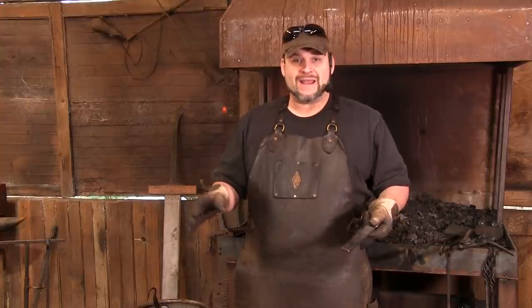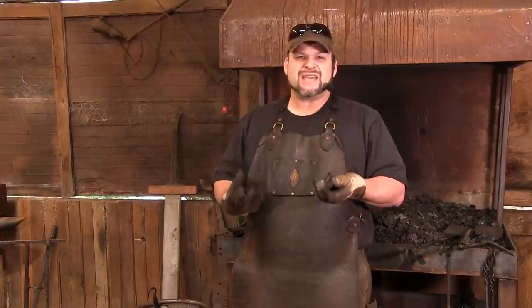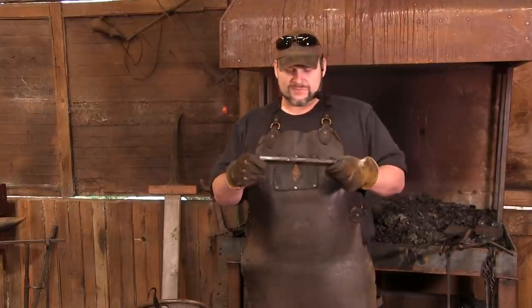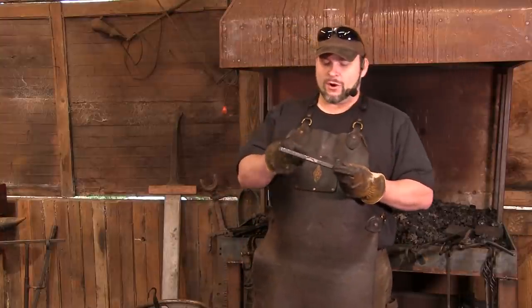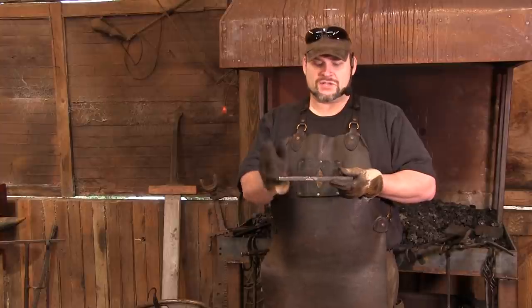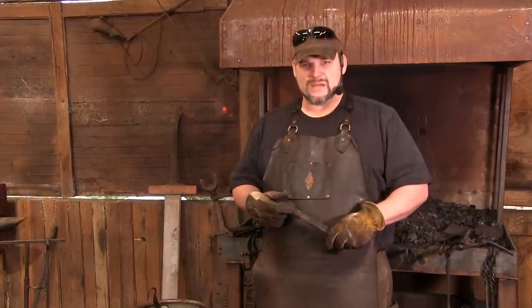For today, I'm going to do this all by hand, but trust me, even as a professional smith, this is a lot of work. You're going to find out that this size steel is the only thing that's got enough beef to make a lot of the tools that we're going to need. The piece we have today is, again, one inch by half inch material — the same stuff I use for a lot of my tongs. It has been cut 10 inches long, and I have marked three inches in from each end. We're going to take this middle section and double it in length, from four inches to eight inches, because we're going to make a loop so that it can go in the vise.